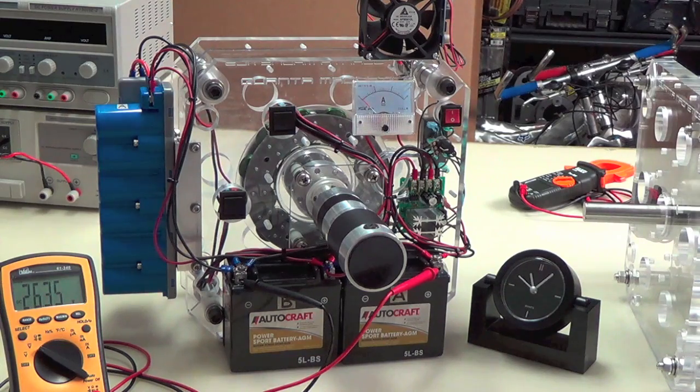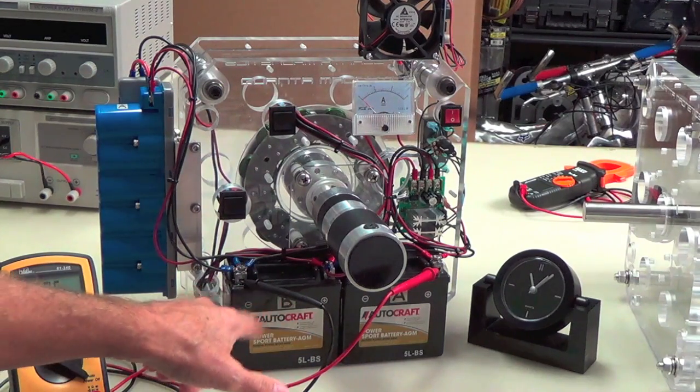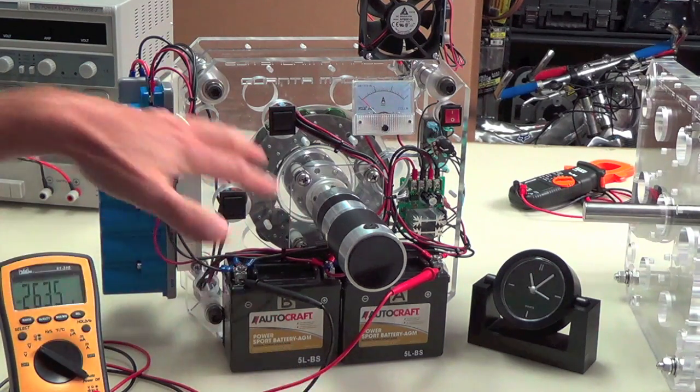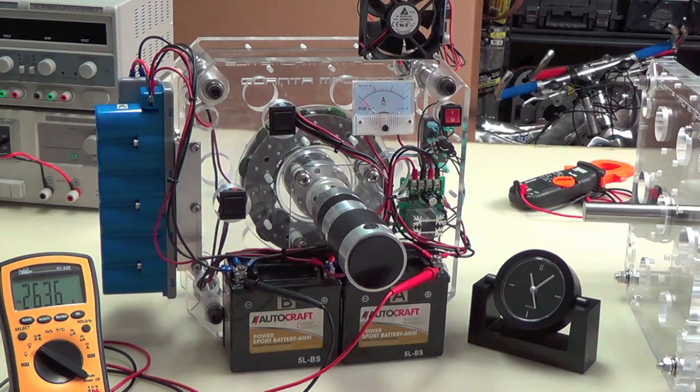And what we're going to do, well, basically that would be 13.16 or 17 volts per battery, which is fine. That's typical standing voltage for these AGM batteries. And what we're going to do is drive these up to 29.5, 29.6, and that'll be roughly, when they settle down, that'll bring these batteries to 14.8, which is a good top side for AGM batteries. You can push them beyond that, but you don't want to do it very often.